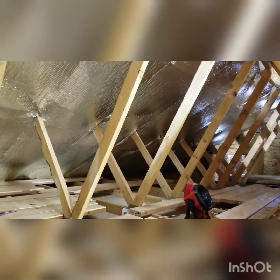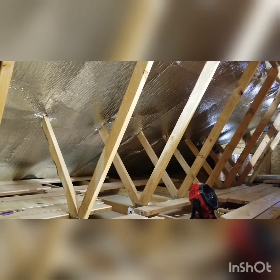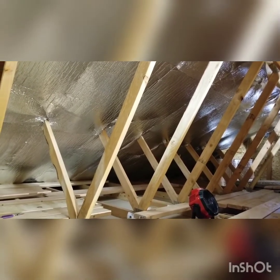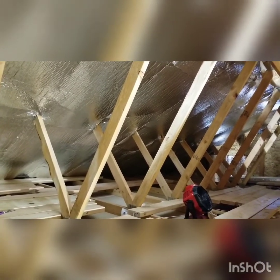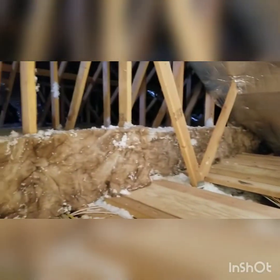Working on insulation and heat reduction in my garage again. We did a video earlier about how to insulate your garage door for less than 50 bucks — we saw about a 10-15 degree drop just in the door. Eventually I want to get full insulation to R45 down the floors. As you can see, the insulation stops at the actual home, but in the garage there's absolutely nothing — no insulation of any sort.